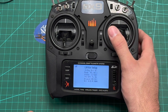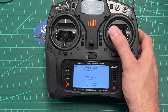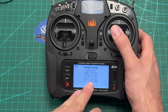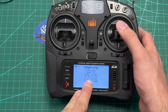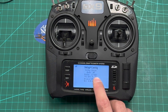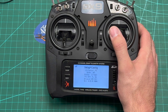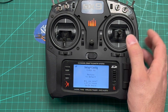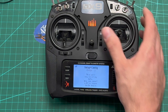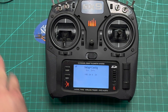From there, you go through the menu and you can see it changing. This is how you change throw rates, gyro control, and dual ailerons. You can turn on the full configuration, then save and exit — or exit without saving if you don't want to keep changes. The mode menu lets you change from receiver-only to V-tail, normal tail, and other modes. You can change the stabilization switch channel, whether the gyro is always on, turn telemetry on or off, reset or cancel the failsafe, reset the receiver, calibrate voltage, calibrate the current sensor, and view system info showing firmware version.